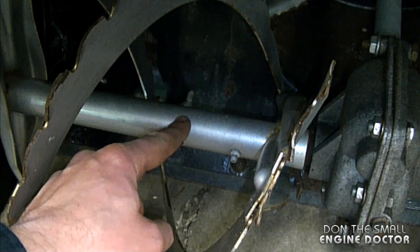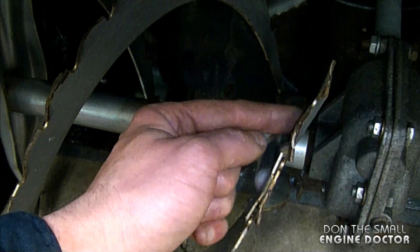It's actually not a true shear pin — it's a regular bolt, and that's bad because if you hit something it may not break, and it can cause damage to your gearbox over here.